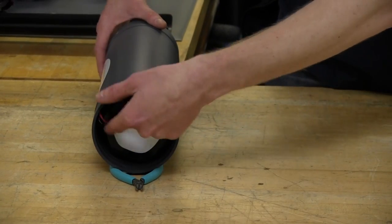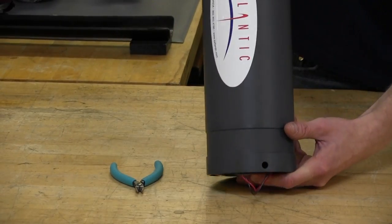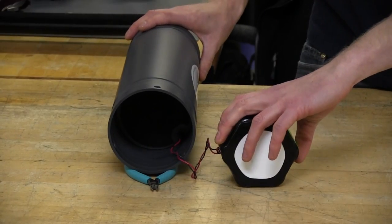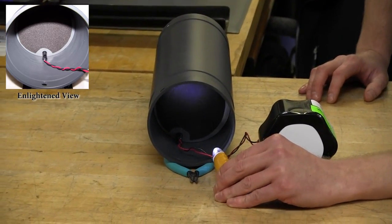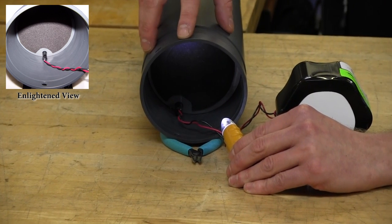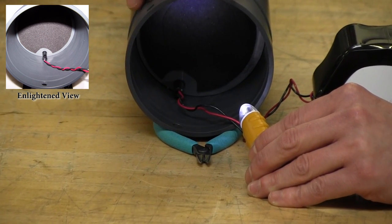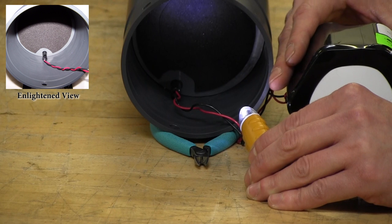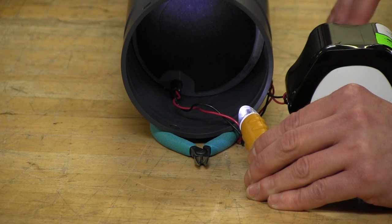Coming back to the CFET, just rotate the housing so that the wiring is upwards — it's going to give you an idea of where that barrel connector is. Next, just take the instrument, gently angle it, and the battery should just slide right out. Using our flashlight, we can see inside the battery compartment. The female jack is against the back plate, positioned close to the wall of the pressure housing to allow space for the barrel connector to rest between the housing wall and the side of the battery. When installing the fresh battery, you're going to want to have the edge of the battery facing the barrel connector to allow the battery to be fully seated and leave a little bit of space for the wiring.